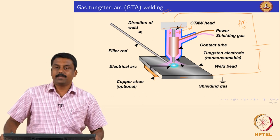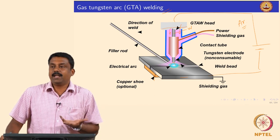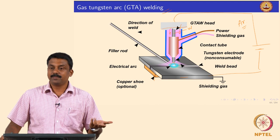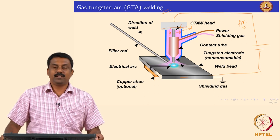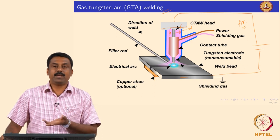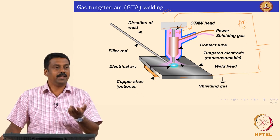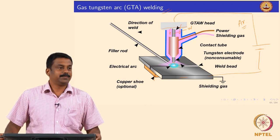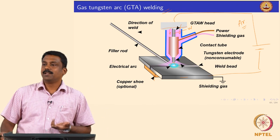The process characteristics are all determined by the shielding gas and the current and voltage. Heat generation is governed by the electric field E, and the shielding gas determines the number of electrons and ions present. The two important factors we can influence are the number density of electrons and ions — determined by temperature and shielding gas chemistry — and the electric field E that we apply.